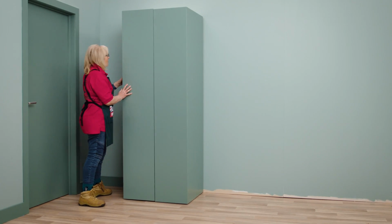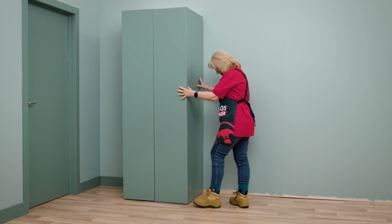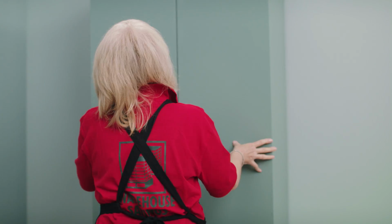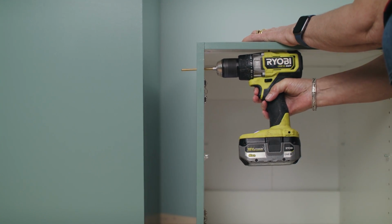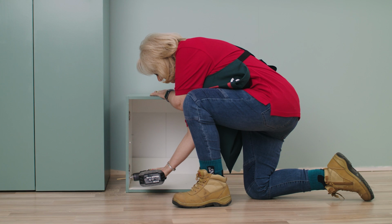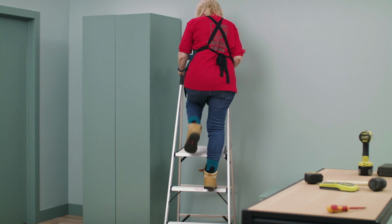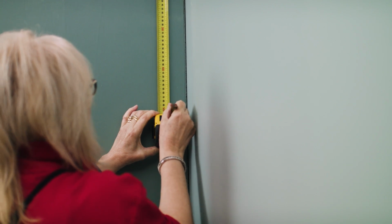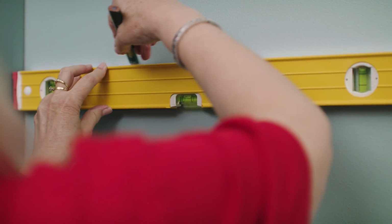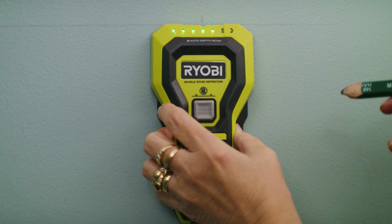This design has plenty of cupboard space, overhead storage and drawers, plus a bench to pack and unpack bags and remove your shoes. To assemble, start with the left-hand cabinet, ensuring it is hard against the wall. To hang the overhead cabinets, pre-drill holes in the top and bottom back rails to prepare for hanging. Measure up to make sure cabinets align with the other units. You'll need a helper for this part.